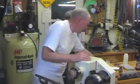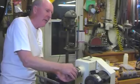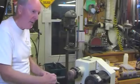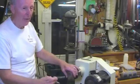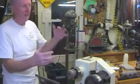So this you can shape as much as you're comfortable in doing. And if you have a large piece, say about this deep, about 6-8 inches, you want to leave enough support here to handle the hollowing procedure. Because if this goes down real thin and you're hollowing out here, you've got a good chance this is either going to go out around on you, or it could tear out of the chuck. If you get a catch, you could even tear out the screws from the faceplate. And then you've got to go back and redo all that you've done.